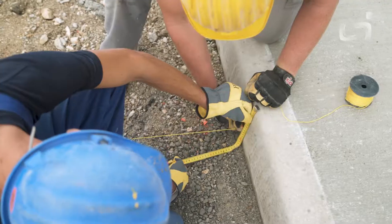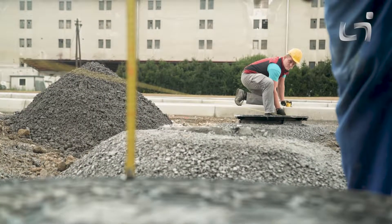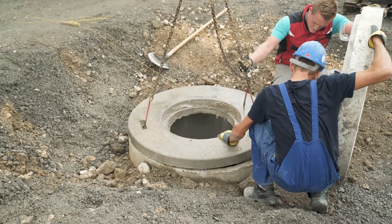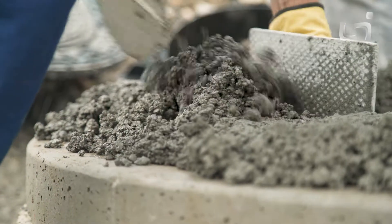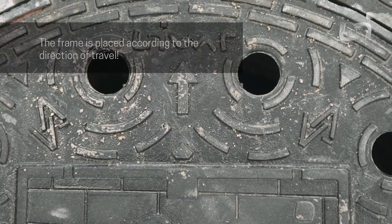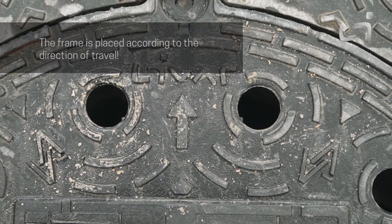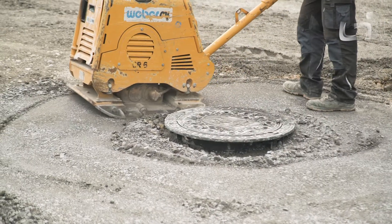Outside these dimensions, we recommend adjusting the height of the shaft itself by cutting it, adding AB rings, or concreting the base. When the heights are determined, the kit is then laid directly onto the shaft or concrete base. The frame leg and direction arrow are then placed according to the direction of travel, and the kit is fixed using concrete and anchors as necessary.